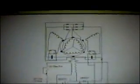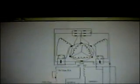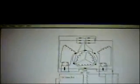The coil here and here on the left and right are the 2 coils, and the set of 6 diodes at the top is the 3-phase rectification system for the 24 interior coils.